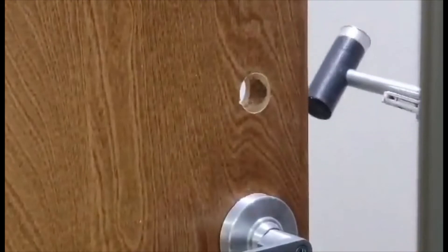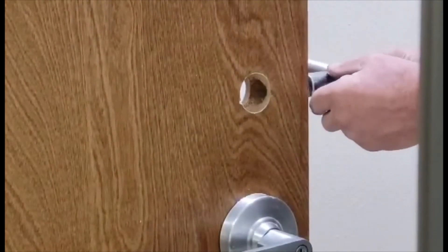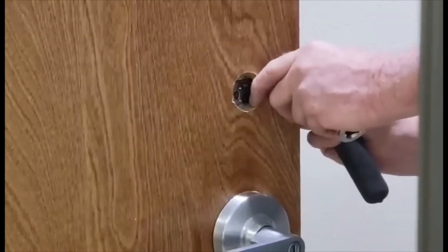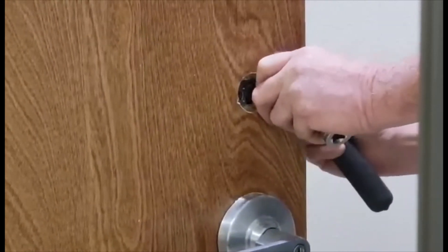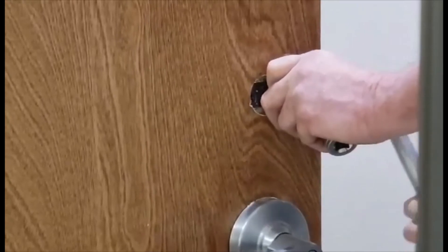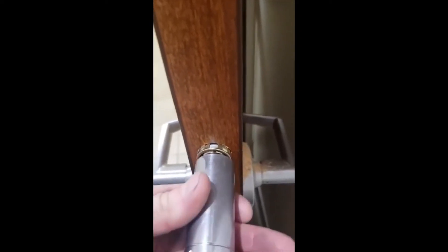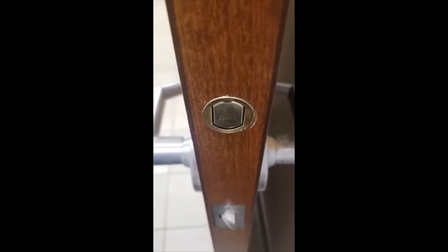Since it's just a kids' bathroom, I'm not using a mortise-in bolt. You set it in there like that. You gotta be really close to vertical — if you're not, it's not going to go in very well. So you can see it's set up here on the door; you just take this and hammer it in. There it is, driven in.